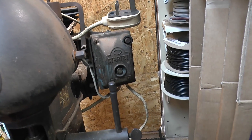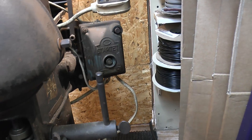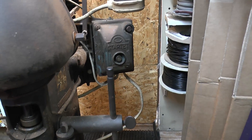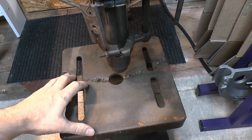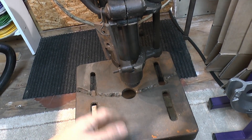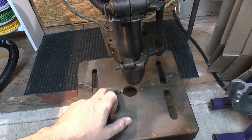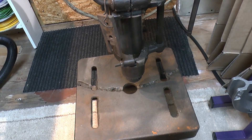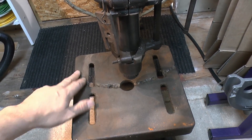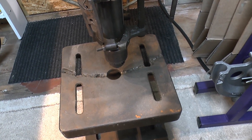The same wiring is also used from the starter to the motor around the back. The starter has some odd traces of blue paint — most of this has no paint on it at all, so it's not clear what colour it would have been. The table, as is often the case with these, has been drilled into — there's an arc of holes because fools, when they adjusted the table, put it out of position and just mashed through with the drill. It's not gone all the way through apart from one spot, so it's not a total disaster. These can be filled with epoxy or welded and ground flat — it's a very common issue with older drills.